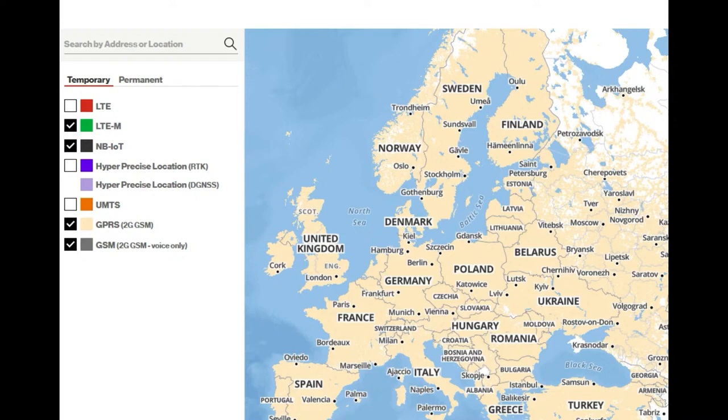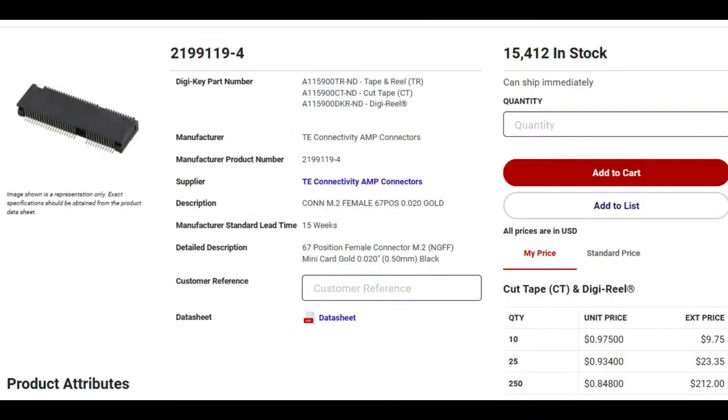What I like about the Blues Wireless modules is they have this M.2 plug-in module, and you can get the connectors from DigiKey for under a dollar. You plug in whatever module you need. So if you have a product going to European, Japanese, Australian, or North American customers, each one you can plug in the module that makes sense for that customer base. And if the networks change over time — because 2G will eventually get shut down worldwide — you can change it out pretty easily. It's even user-serviceable: a technician with very little skill could go in with a screwdriver, pop it out, put it back in. You can't put it in backwards.